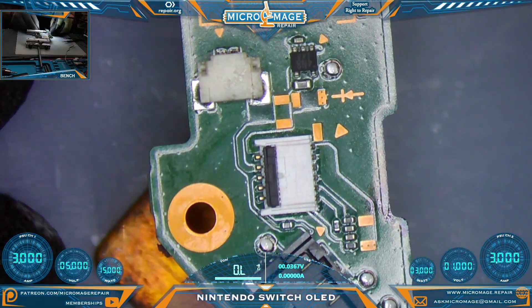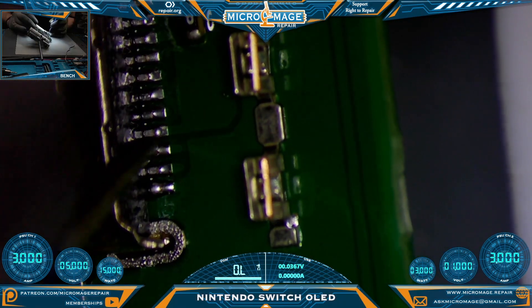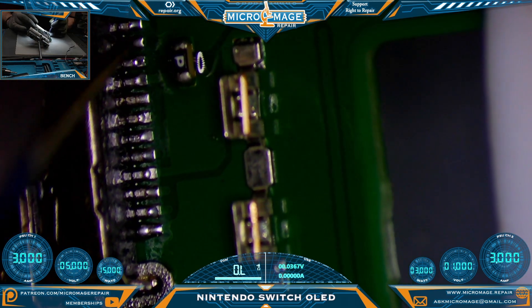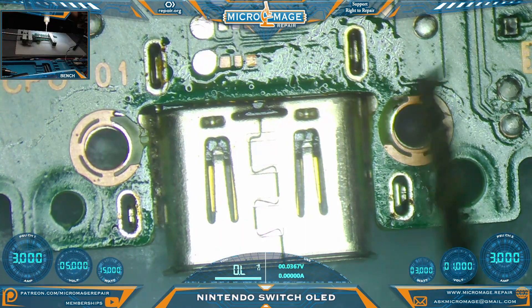Good - check our connectors. No burning, no singeing - excellent. Check this visible row of pins just to make sure everybody is solid. Sometimes when you're concentrating on that middle row, which is the important part, these can get neglected. But everything looks solid - nice fillets. We have flipped the board.